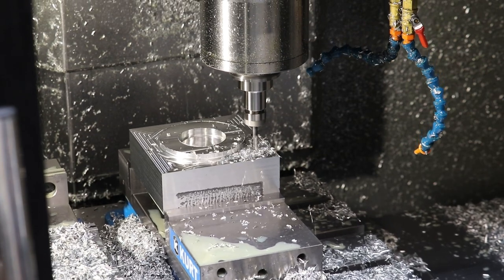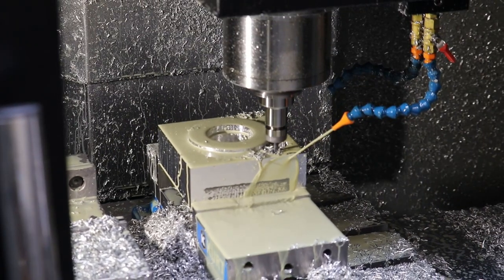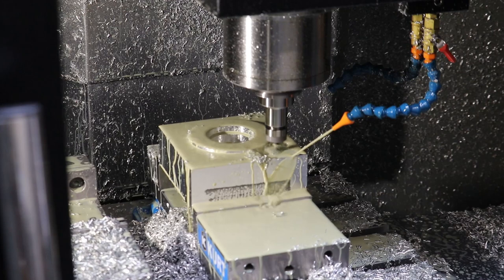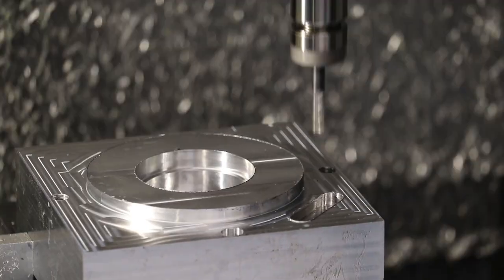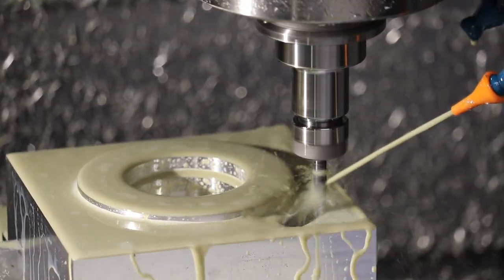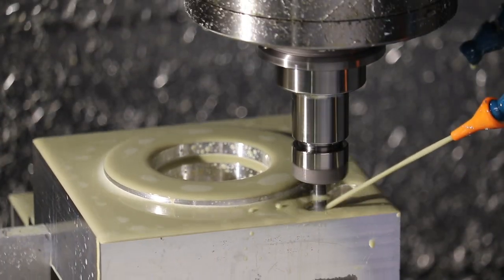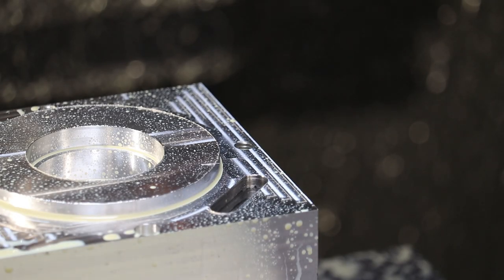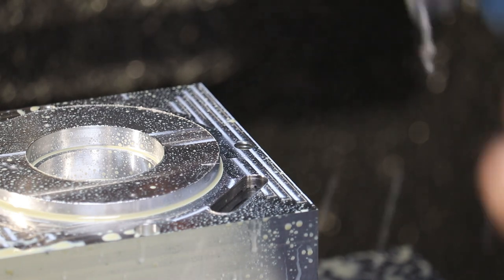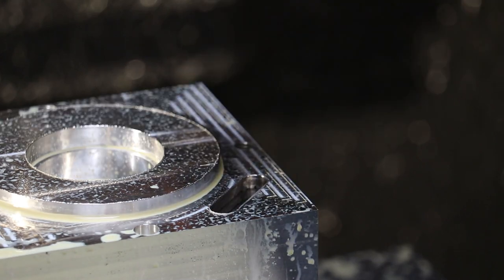of the molding machine. And here I'm machining in from the backside some keyways for some aluminum wedges, which I wound up actually replacing with steel plates. Some of the features in the other side of this mold required sharp corners, and I didn't want to EDM in sharp corners, that's electric discharge machining. So I wound up machining these slots, and I machined some tapered locking wedges to basically wedge some plates in from the backside to create a tapered or drafted sharp corner on the other side of the mold. So that's what that is, and that's the wedge that I made.